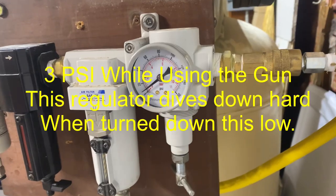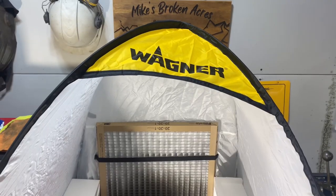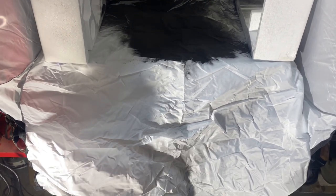If you notice, I wasn't pulling the trigger all the way and I had my PSI set at about three PSI for that whole spraying. I did make one mistake with my pop-up spray booth - something you guys can avoid if you get one of those. It's a Wagner, but I had the box fan set all the way on high. I should have had it on one, because it was fighting for the electro charge for the part with the powder - the fan just wanted to pull it away. So when I do all these other guys, we're going to turn that Lasco box fan down to one.